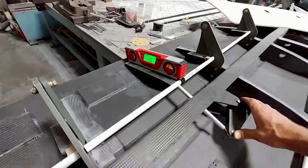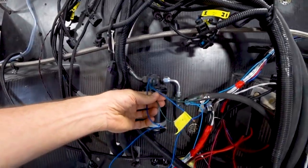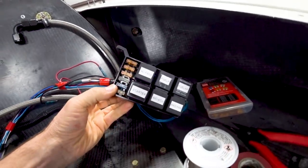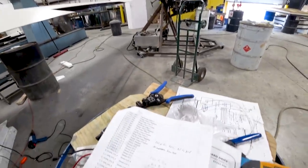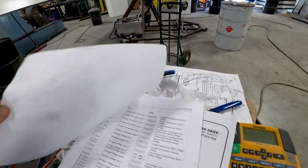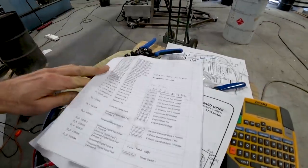Mark's a little concerned about the angles coming off everything, but I don't think there are any major problems we can't figure out. The next problem I'm working on is getting the air conditioning wiring in the back sorted out, and at the same time cleaning up, labeling the relays and fuses, and tidying up some messy wiring. I'm also unit testing the AC circuitry to make sure it's going to work correctly.